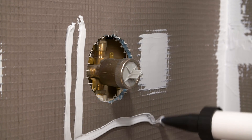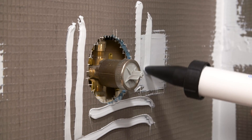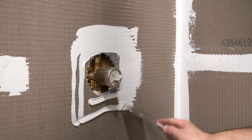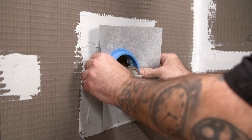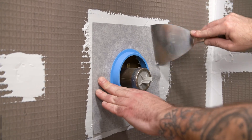It is recommended to address the plumbing penetrations in a WEDI shower with a flexi-collar for the valve area and a waterproof sealing collar for the shower head. The installer will use sealant for the collars. Apply a few beads of sealant and flatten it with a putty knife. Attach the collars and ensure the membrane flange is completely embedded into the sealant.